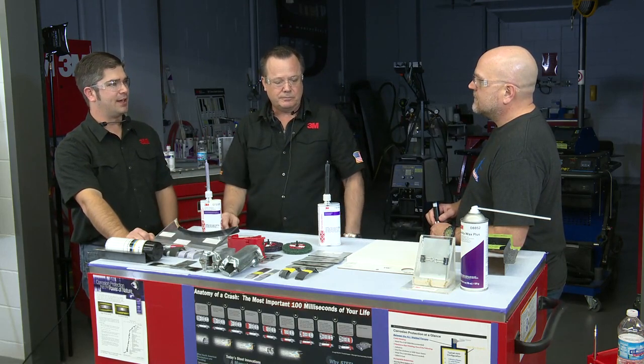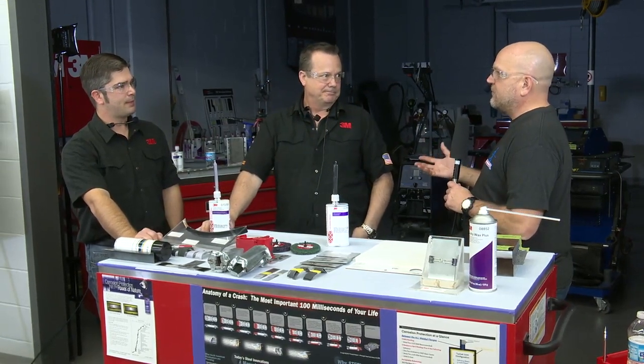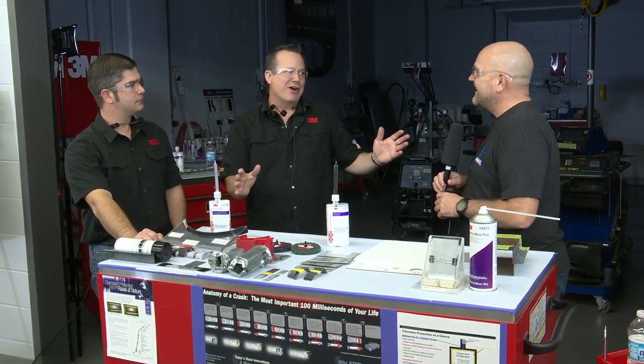The clamp time and paint time are key, and that's with all of the two-part products, seam sealers and adhesives. But again, if I'm in a hot climate, maybe bring that stuff to the front office. Yeah, in the air conditioning or whatever. Don't just tease the office people, you know.